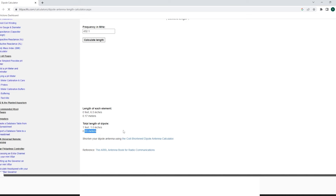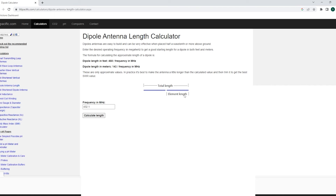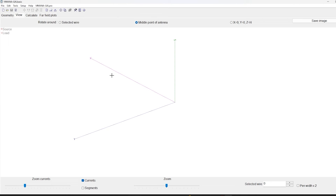This calculation is for a wire antenna, but I'm using pipe and have metal objects nearby, which changed the tuning of my antenna. Ideally there should be nothing around your antenna — in my case I had to cut about an inch off. Without special tools or measurement equipment, how do we know how the antenna is performing? There are a number of programs out there for simulation, but I'm going to show you one that's free — MMANA-GAL Basic. It allows you to put your antenna elements in 3D space, check the impedance, see how it's performing, put in multiple elements to direct RF energy, and see how antennas are performing in theory.